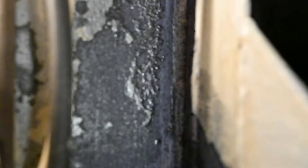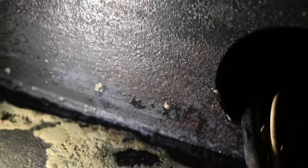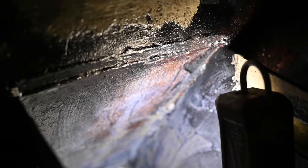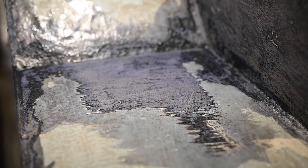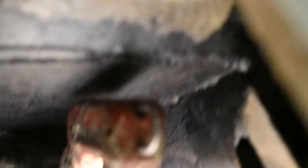So this is interesting — take a look at what we did yesterday. You can see all this black and kind of bluish stuff. That is where we put the Blue Steel yesterday, so the color definitely did convert. But you can see there's still some rust showing through. I'm definitely going to have to put a second coat on because a lot of that still has rust showing through. Theoretically two coats should be enough, but we will see today. Lots of rust showing still, even though I coated all of that in Blue Steel. But lots of it doesn't have any rust showing anymore — that's all converted nicely. So today I'll have to recoat all the spots that still have rust showing, and I've got to acetone in there and then use the rust converter.